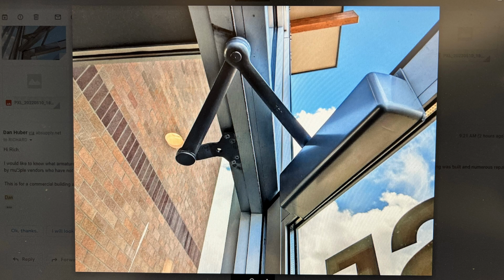Yeah, we wouldn't want to. Pretty sure they wouldn't want to. But door closers are not stops. They're not intended to prevent over-swinging of a door. They're just meant to close the door, and you need auxiliary hardware to solve the problem of it swinging too far open. Okay. So it had a door stop on the ground that broke, because the way the wind often blows really hard, it catches that door when someone opens it.